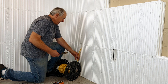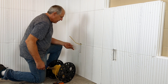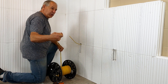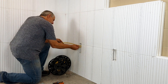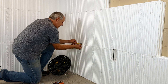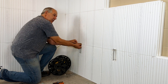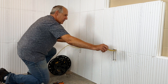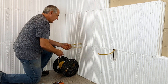Now that I've got my vertical run done, I'm going to cut that off. You want to get your wires hanging out of the wall first — you don't want to mount your boxes first and then put the wire in. Now we're going to put in the horizontal. Get it into the raceway, find the path, and just slide it over until it comes out in the next spot. So simple as that — you can go eight or ten feet without fish tape at all.